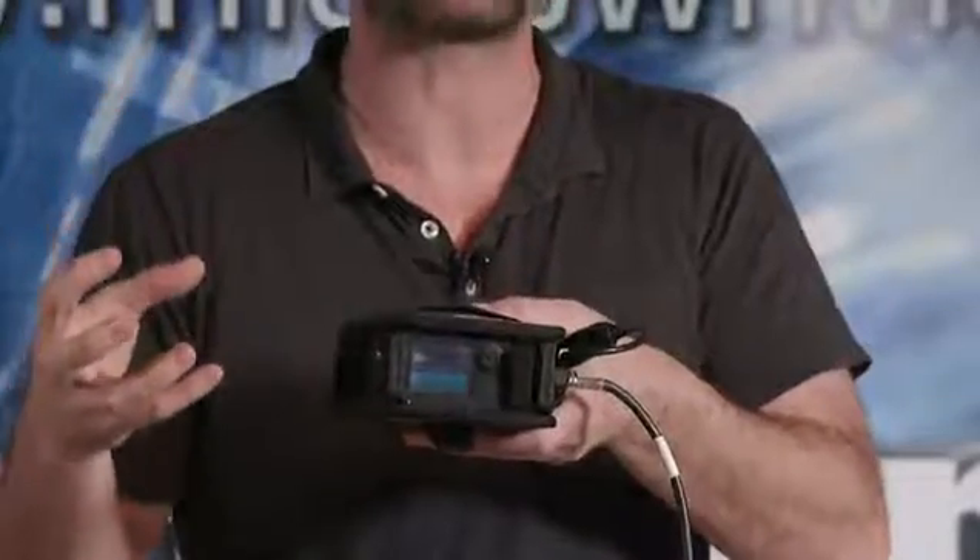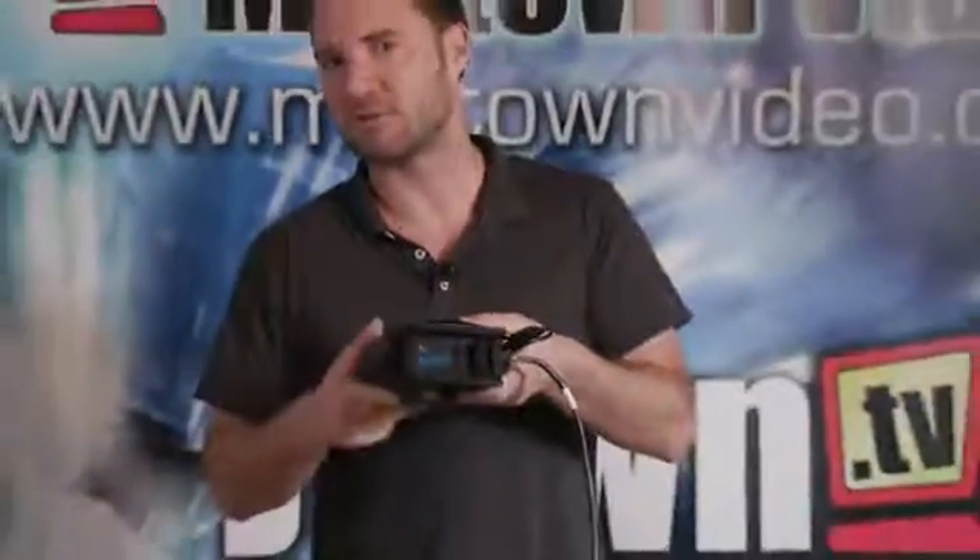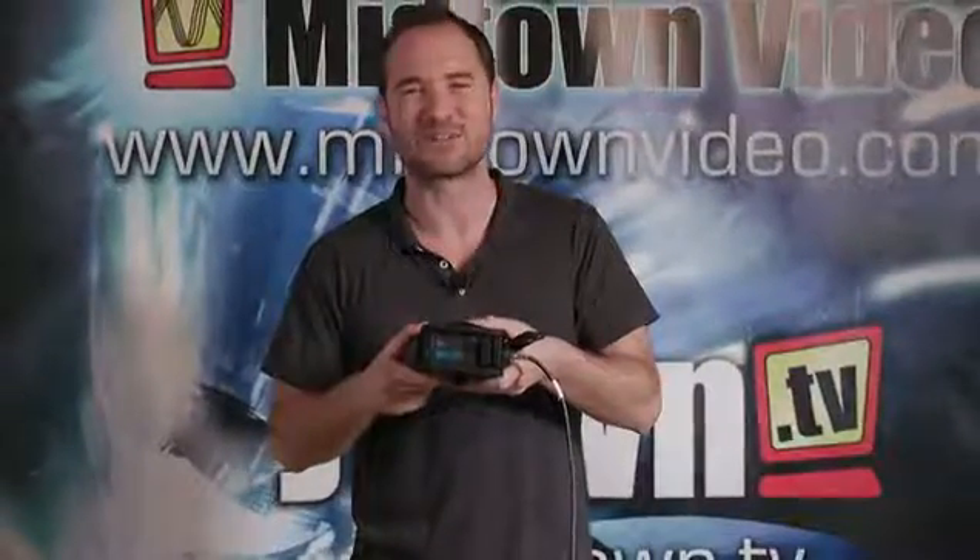That's an incredibly high bandwidth. Of course, if I wanted to in software, I could dial that down a little bit to make sure my 100 kilobit per second users can watch. But what we're getting from LiveU is an extremely efficient video encoding codec, so I'm getting great video — and also super low delay, because LiveU has some proprietary forward error correction and the ability to distribute these 8 megabits per second of video across my multiple streaming methods.